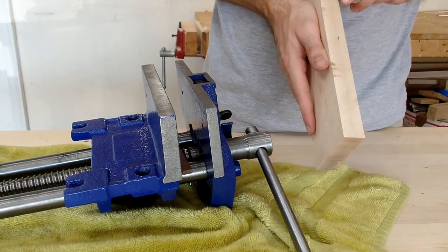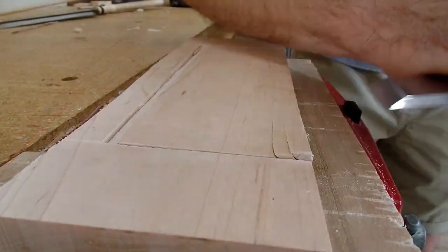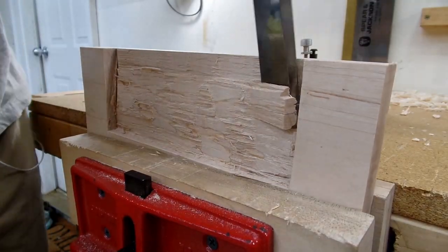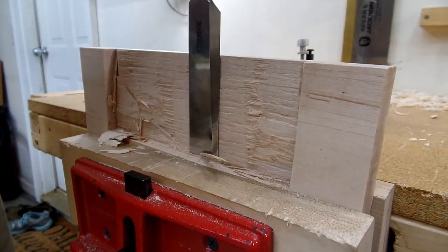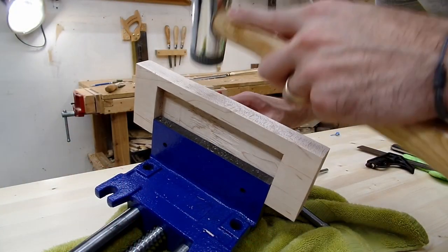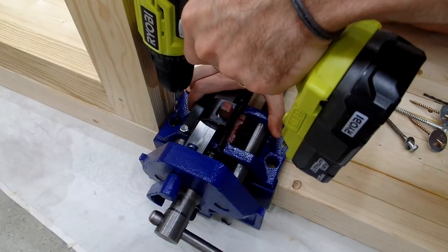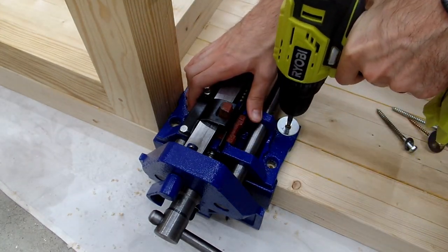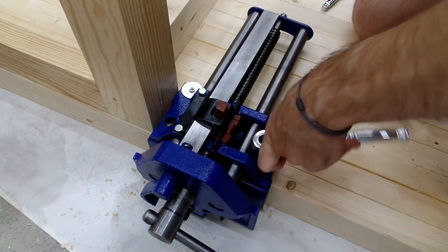As I'm installing the vise, I want to explain why I chose this workbench design. The first thing I wanted was a solid wood top. I've gotten used to having a large work surface, so I knew I didn't want a tool well, and I also wanted the weight that comes with a laminated top. The next thing I wanted was an open base that I could fill with lots of drawers — I'm desperately in need of storage space in my shop, and tired of having odds and ends scattered about. Plus, the drawers will add further weight and rigidity to the bench.